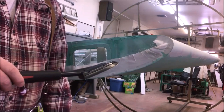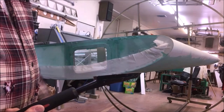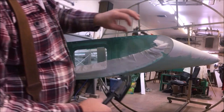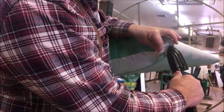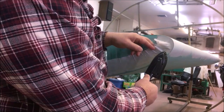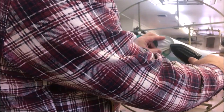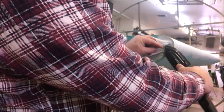It doesn't matter. Another myth that floats around all the time is that you can use the little laser temperature checkers. Those aren't accurate on this. They glance off, and you don't get a good, accurate reading. So at any rate, candy thermometer is, as Ray Stitt said, the standard, and it is. Candy thermometer, bedded into paper towels. I was told the other day that the little Coverite thermometers that we've depended on for so many years are no longer being made. So if you've got one of those, take care of it. They aren't totally and 100% accurate, but they get you in the ballpark good enough.